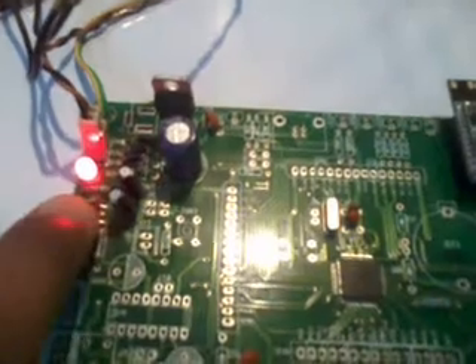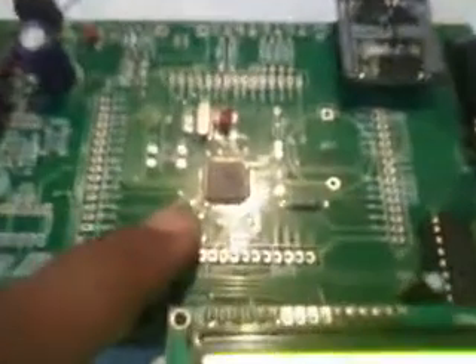The 9V output feeds into two boards — one board contains the fingerprint module and the other is the ARM development board. On the ARM board we used a bridge rectifier, a filter capacitor, and a 7805 regulator — that entire section is the power supply section, converting AC to 5V DC. We also used an LM1117 fixed 3.3V regulator.